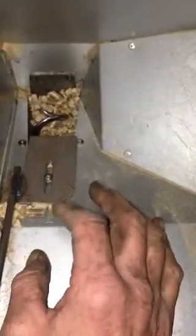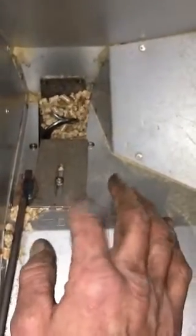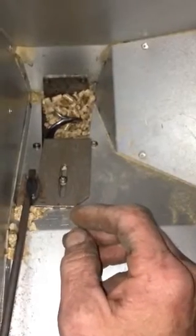One more thing. It's real good down in the hopper. Down inside here, you can see that's the auger. Let me get my pointer. That's the auger. And that turns and then the pellets feed up and they drop down. We're at the drop tube inside there. In the springtime or whenever, it's good to empty all the pellets out and then take your vacuum down there and suck everything out of there, and you can bang on the auger and all kinds of sawdust and stuff will drop down, and that sawdust will start to block off the correct amount of pellets from feeding, and then you'll start to have problems with the stove working right.